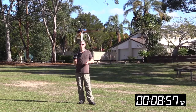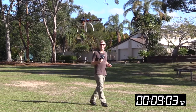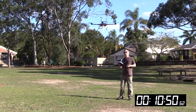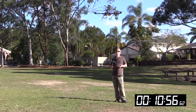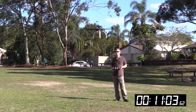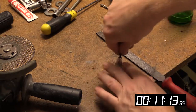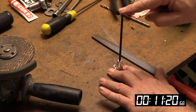Not real exciting looking at this, just hovering there, but it's always good to know what your limits are. You need to establish a few things — it's nice to know what flight time I can expect before actually going flying. I did modify this fold-over GPS mount, as you probably saw in a previous video. Even though you tightened down the knurled knob, the antenna mast was still rather loose, so by grinding a bit off that knurled knob it would actually lock in as you tightened it down. We don't want vibration, particularly on the GPS compass module up top.